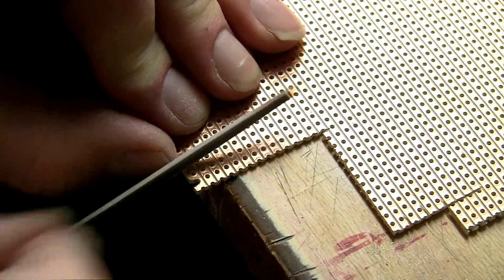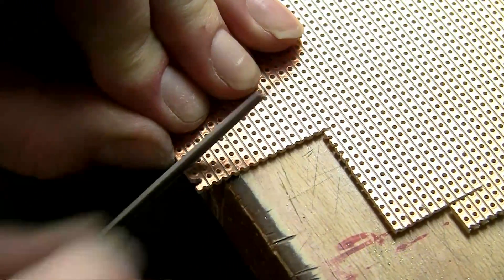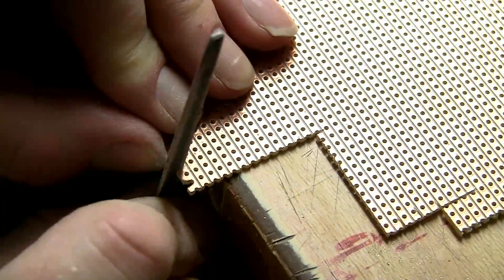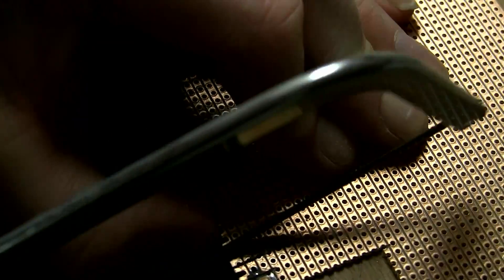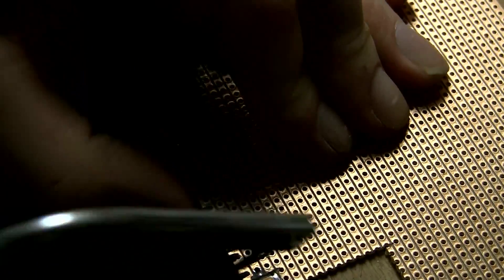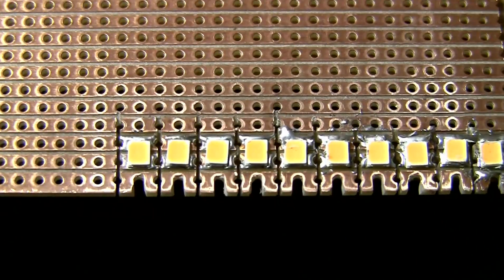The base and the lamp part consist of a circuit board — a pre-made experiment board which has etched copper lines and drilled holes. I'm using a metal file to cut slots which are two millimeters wide, which is exactly the diameter of the top part of the pole. Next I'm sawing the width of the lamp head before soldering the LED, because it's much easier to cut this before soldering. It's very easy to damage soldered components and tricky to solder onto very small PCBs, so it's better to have them fixed already.